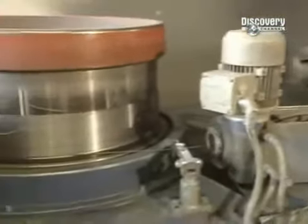The wire's diameter is 6 millimetres, which is too large, so a stretching process reduces the steel's width. Using many drums, the wire is pulled repeatedly to gradually thin it, and is then rolled onto a drum.